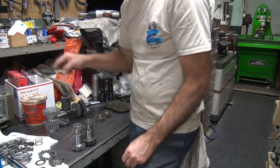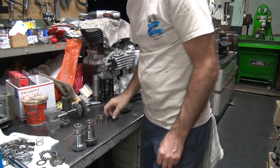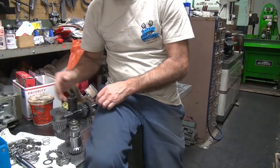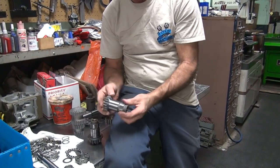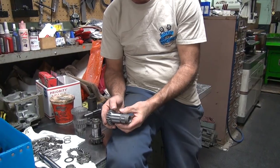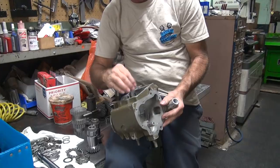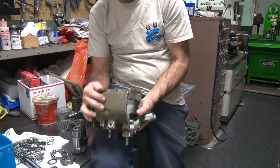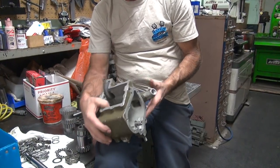It's causing issues. So the second gear plate is going to keep us from moving the whole assembly over. Well, that's a constant. That's not adjustable. Yeah, it's a fixed hard point. You can go in there and grind it thinner, but you can't move it. It's held in with the two screws right here. Right. Can't move it. It's also against the shoulder in the case. You look and there's a big shoulder in there.